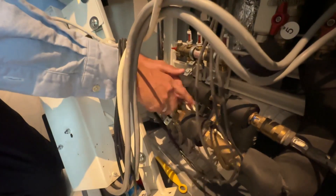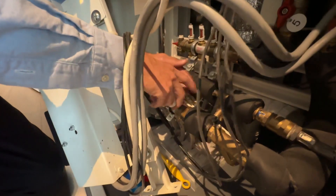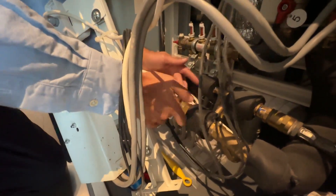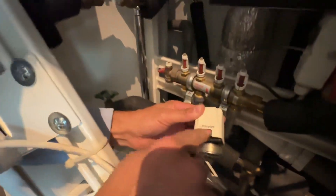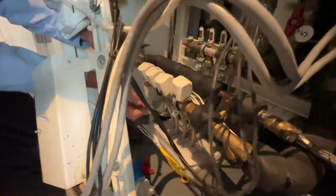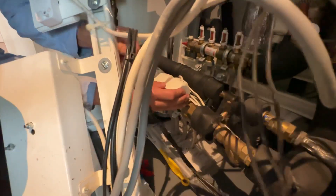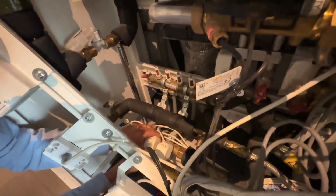If the fuses are intact and the system is still blowing, it's typically due to one of these being defective. I'm loosening — the screw underneath turns separately and the red bar should be intact. This one is fine. They are labeled: living room, bedroom one, bedroom two, and that one's unlabeled — but keep them in the same order. If necessary, just gently put it back on. Let's get the others off, and then I'm going to ask David if he's got a teaspoon — I'll explain that in a minute.